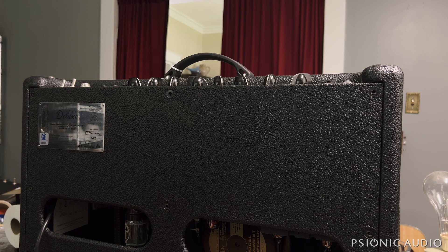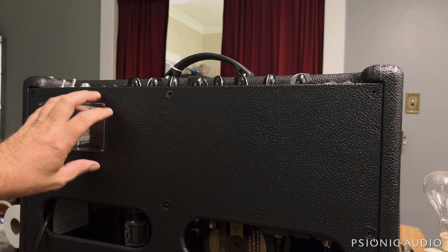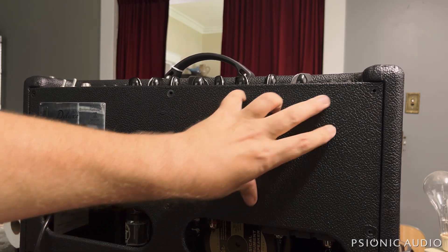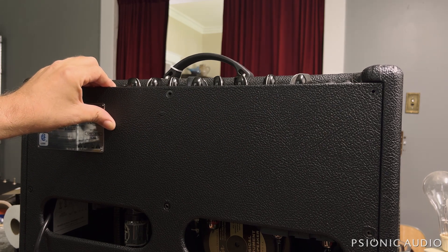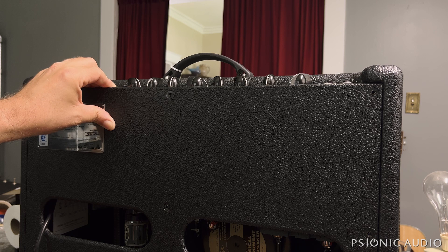Most of the time when there's an actual failure in these amps, it's the low-voltage supplies burning things, or the filter caps are burning or leaking, or there are bad solder joints throughout, or some combination thereof. And whenever I report that, people say mine's never had any problems — congratulations — or that I just hate Fender or I'm inventing stuff. I'm really not.